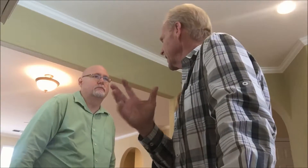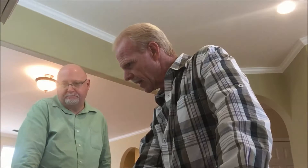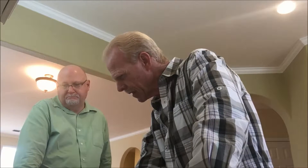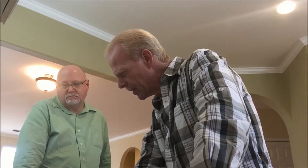Electrically, it's a nice big 200-amp panel and it's only half full of breakers — you could practically run the house next door. A lot of room if you ever want to add a spa or anything like that. No jerry-rigging in it, no two wires on one breaker, no double-lugging neutrals — nothing like that. I do have a lot of light bulbs burned out in the house — outside patio lights that were left on, and some bathroom lights are burned out.